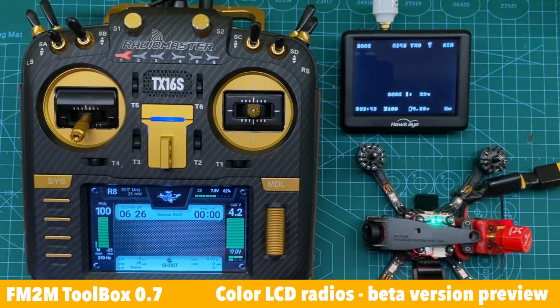And here is the cell voltage, average cell voltage, total cell voltage, and a graphical representation of the cell count. Let me drop down the voltage. It's hard-coded now, you cannot change this. I think it's hard-coded to 3.7 to start the low warning. Let me check. Yes, it goes yellow, so it's low level. And let's drop the voltage even more. Yes, now it's critical.